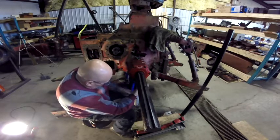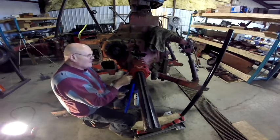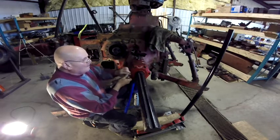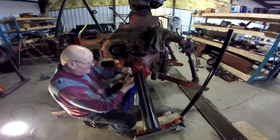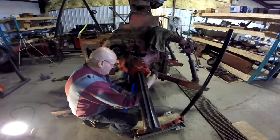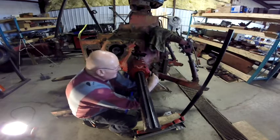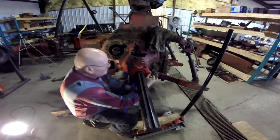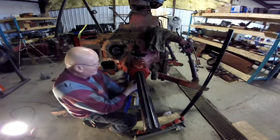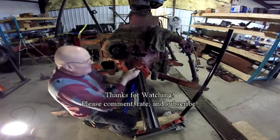As we get another lull in the conversation here as I'm doing this, I just want to reiterate that I'm going to try and get the O-rings for the tubes that go into the TA. I'm also going down to the Case IH dealer, somebody that I haven't tried, to see if I can find a rebuild kit for that brake valve assembly. I really just don't want to pull that thing apart without knowing that I can get the parts to rebuild it in case I screw up the O-rings or the gasket.